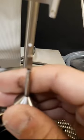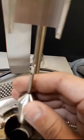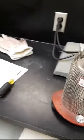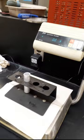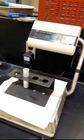This is the rotational viscometer. We have here spindle number 21, and according to the specifications of spindle number 21, we should add about 7.5 to 8 grams of asphalt into this chamber here. I will go ahead and add that now.